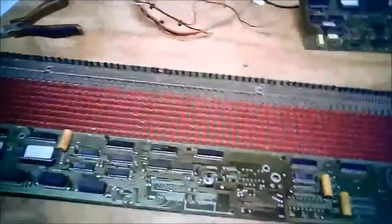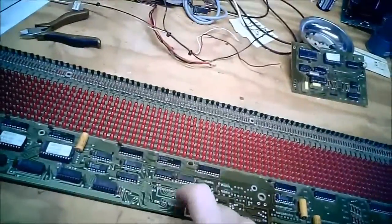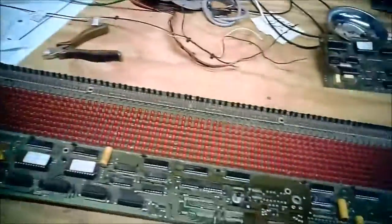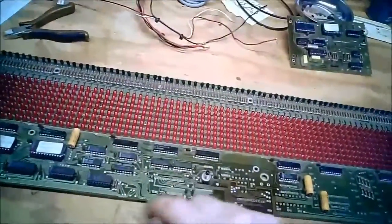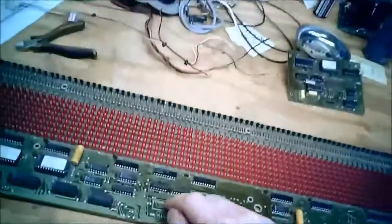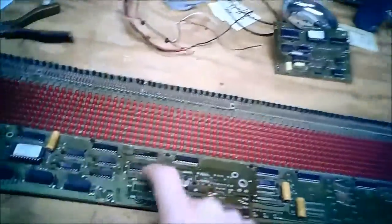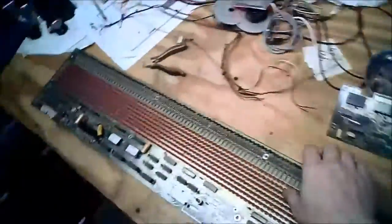So, yeah, these two chips here, their only purpose in life is to divide down the system clock. The system clock comes into this chip here and needs to be 30 times faster than the shift clock, which these two chips divide down. So both of those can go away. UART's gone. I'm never going to use it. It doesn't feed anything else. They're just taking up power. So back over here we go, and into solder mode.